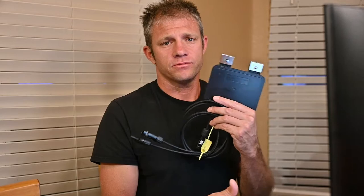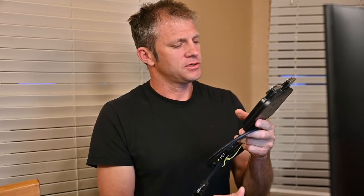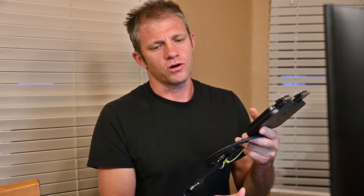And then, if you opt to buy the Tigo Rapid Shutdown modules, which are required for solar panels on your roof, you need the Tigo Rapid Shutdown units. These are the TS4-AFs. They do a single module at a time, and they're rated up to 90 volts, 15 amps and 500 watts. So it's essentially one panel. You can get them for two.